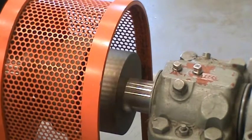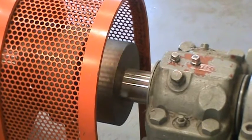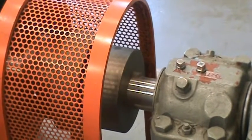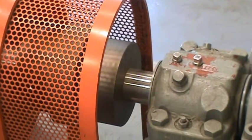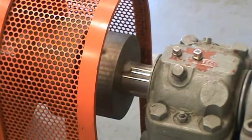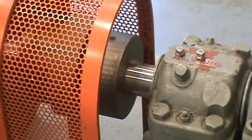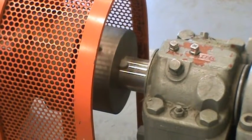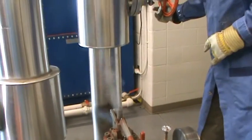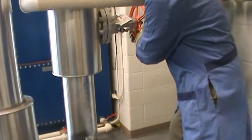This is the safety device: if the turbine is running too fast, the mechanism will stop the turbine itself. Every time we start it, we have to test it to make sure the linkage is working before we actually put the turbine online. You can see the turbine is slowly slowing down — we just wait a few more moments until it has stopped. Now it's pretty much stopped.